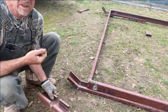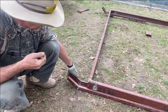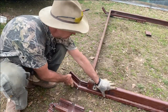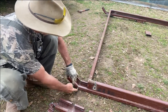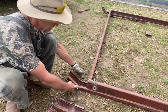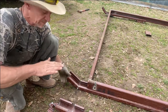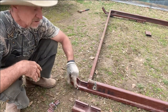Let me show y'all what I was cutting on. On each end I'm taking a piece of this four-inch C-channel and cutting a notch right here to set it up under this frame, that way I can weld it down the side. Then I tilt this up and weld it, and I'm gonna put my pull chains welded to this bottom piece — that way nothing's pulling on my frame when I hook to it pulling it around. When you're pulling it, it'd be like a sled. I had to do four because I'm gonna have it where I can hook to it on either end.